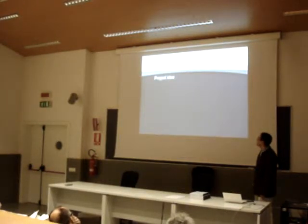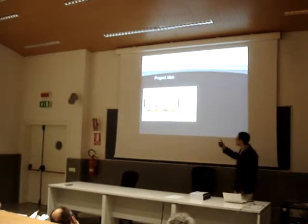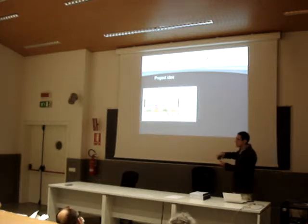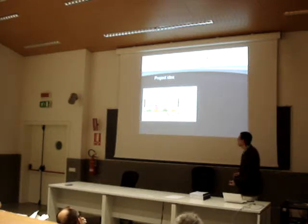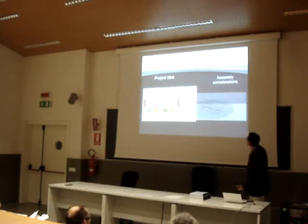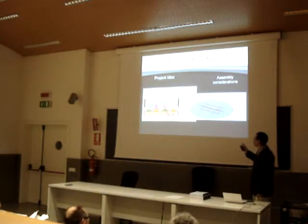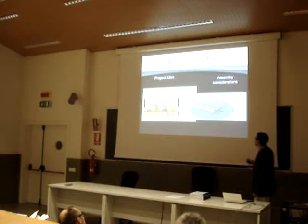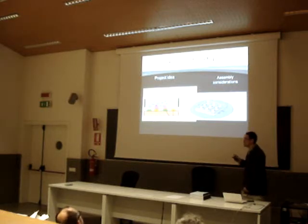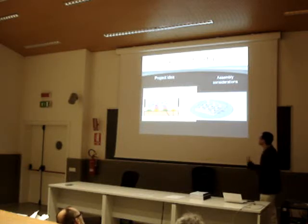First, we design. The project idea is to have electrodes that can affect the bacteria on the gasket, and the bacteria can be repelled all the time without being attached. And we can create an antibacterial surface with that. So we have to consider a wafer with electrodes and a gasket with a fixed hole diameter, and then it's going to be attached to it. And we have to consider that it must be sealed, so there is no medium poured out.